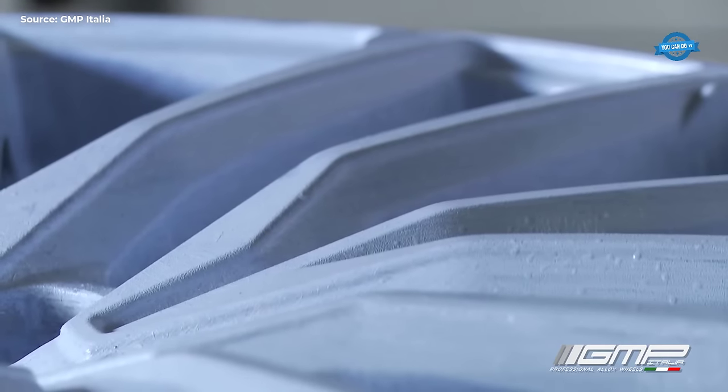Once the metal reaches the correct pouring temperature, it is poured into the ceramic shell molds. The metal completely fills the cavities of the mold, taking on the geometric shape of the wax patterns. Any internal details are formed by soluble wax or ceramic cores, which are surrounded by the molten metal during casting. As the metal cools and solidifies, it forms the final cast components within the ceramic shell molds, maintaining the intricate details and precision of the wax patterns.